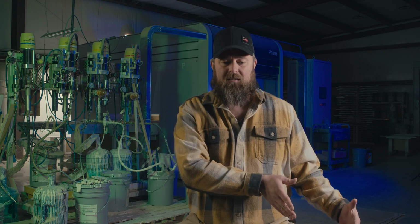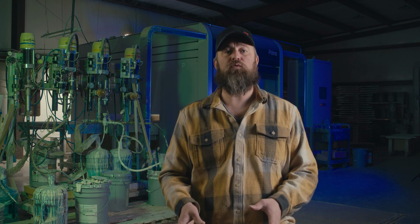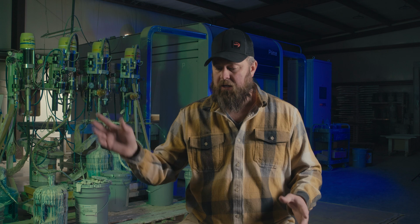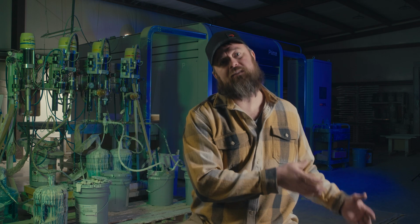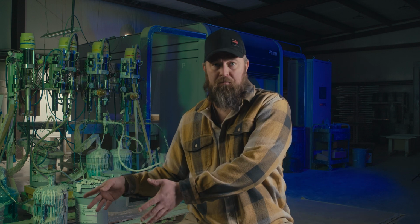To put it into perspective, before we made the jump to a flatline spray system, I would say, just for the sake of simplicity, on average we were painting about 2 full kitchens a week. And that is complete painting, doors, you've got to flip parts, all the parts. In those 2 weeks, let's say we use 25 gallons or so per kitchen, you're using about 50 gallons of paint a week. And it's easy to see, once you've got the kitchens done, how much paint is left over from the paint you bought for that job. And then you can do the math and figure out how efficient you are in terms of buying the amount of paint you need and then spraying it.